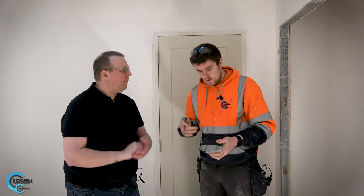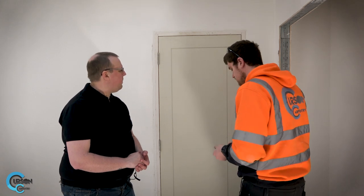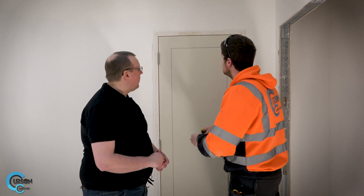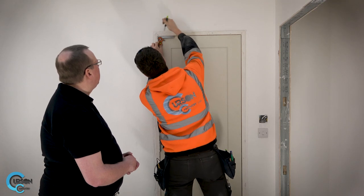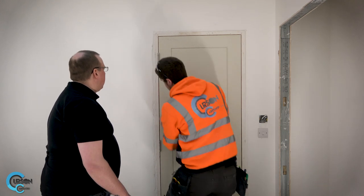Right, so what's first? The first step — what we're going to do is we're going to mark around the edge of our door lining, so that we know when we come to fit our architrave where we've got to set it back to. Easiest way to do that is a combination square. We can set that to 8mm and then mark it. It's a little bit awkward on this side because I've already swung the door. You just want to mark that in four or five places.